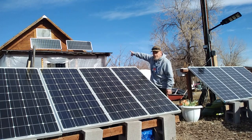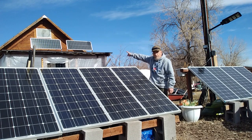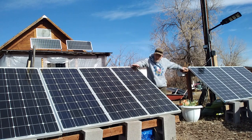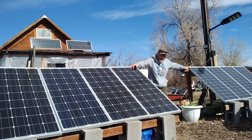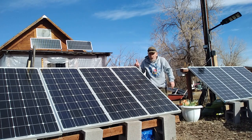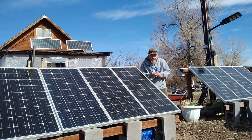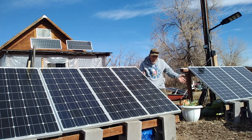I've got those two 100 watt solar panels up on my porch roof and those will be used for my recharging station. I also want to show my two 400 watt main systems — one is four 100 watt monocrystalline panels running as a 24 volt system, and another 400 watt system running as 12 volt. Those run everything in my cabin. The recharging panels up there will be used for my e-bike, running my computer, laptop, Wi-Fi system, communication systems, and recharging tools.